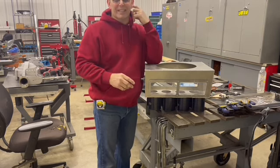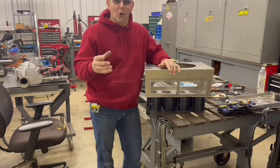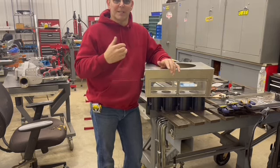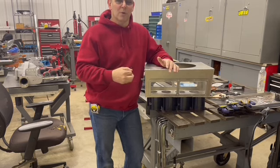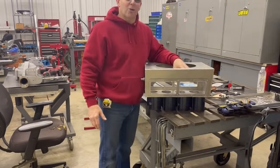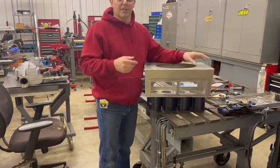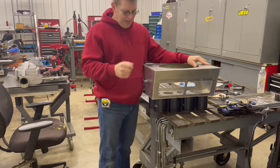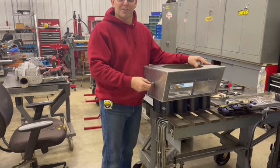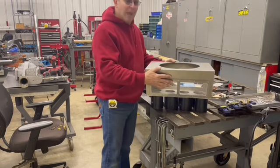So we didn't really measure things for horsepower or torque. They're relatively short, which we believe is better for what we're doing. We're going to find out once we run the thing. But we wanted to measure air going into the engine. In order to run the management system that we are, the electromotive that's on the engine right now, we needed to be able to check ambient air temperature. This is our air temperature sensor. It plugs in, and air comes in through the top of this box.